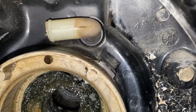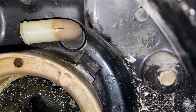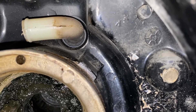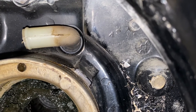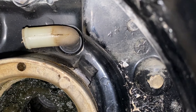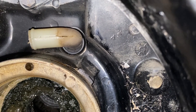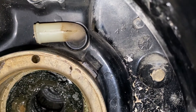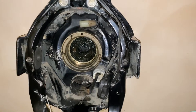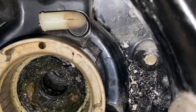You can see the rubber fitting that the water tube itself goes through. The purpose of that fitting is to create a watertight seal at that exact spot for the water tube and transom housing as it travels through the hull into the additional rubber hose internally. If that fitting is dry-rotted, cracked, or damaged in any way, that is going to allow water inside the hull of your boat. Because if you just replaced everything that could cause a leak but forget about that one bushing, that may still be your issue. Scrolling above is a video link where we replace that exact bushing.